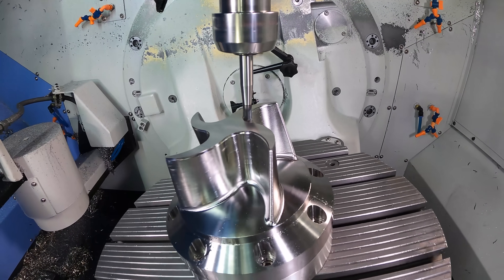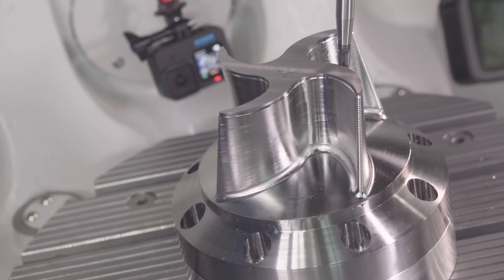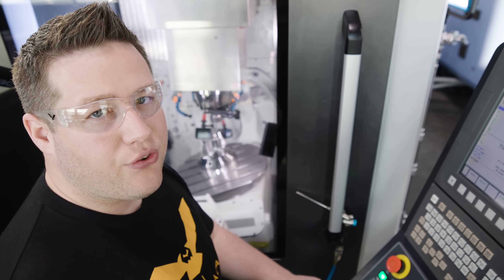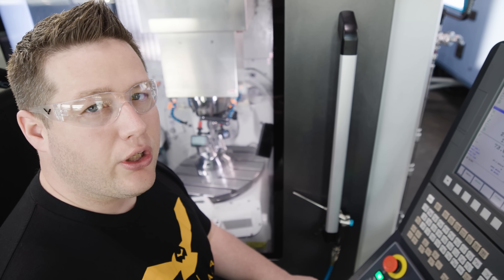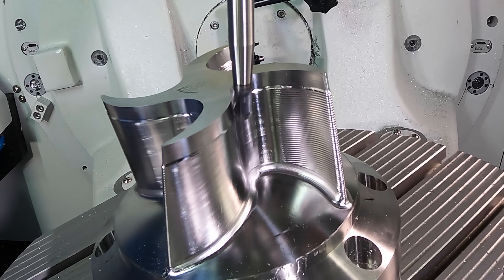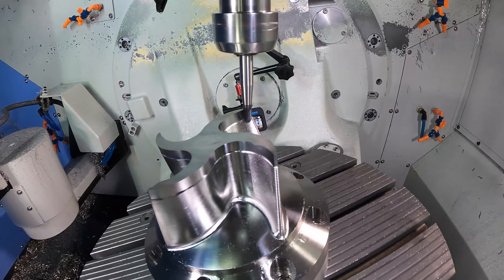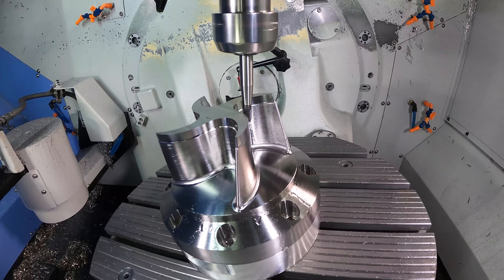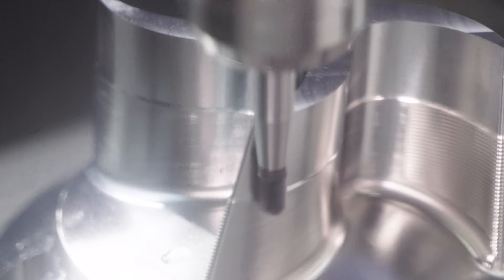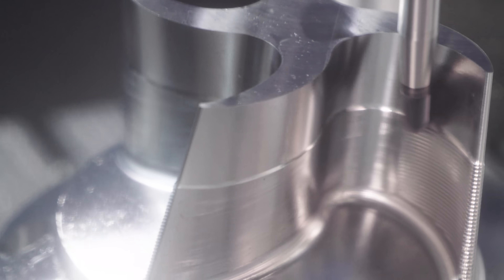Notice how our finishing tool has a long projection length and I'm using a hydraulic holder. If you watched the roughing video, you may be wondering why I didn't use a similar setup as the quarter inch ball nose in a shrink fit holder so the tool didn't have to stick out so far. I certainly could have done that here as well, but if I would have done that, then as the tool is finishing down the wall, the closer to the bottom it gets, the tool would have had to tilt further and further away from the wall in order to clear the holder.